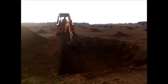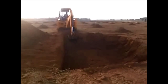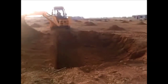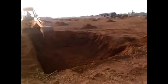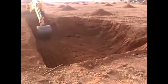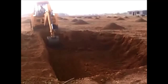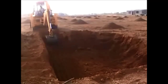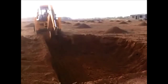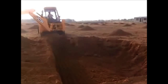Today we are digging an SST for our drip irrigation system. SST stands for subsurface tank. The size of this SST is about 41 feet by 41 feet by 3 feet 6 inches high, which is approximately 150,000 litres in capacity. We are going to have four borewells as input to the SST, and then one output which goes into the mains and submains of our drip system.